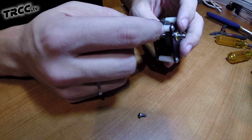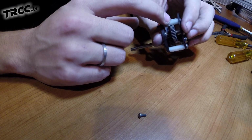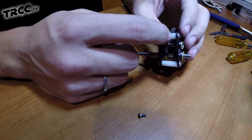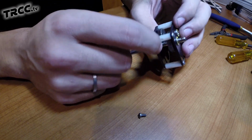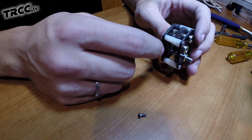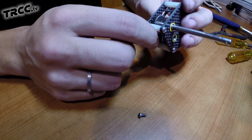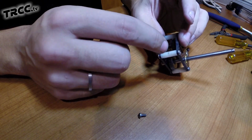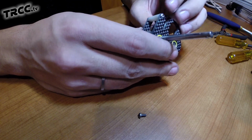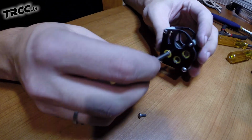But anyway, depending on where you drill the cross holes, none of the gears are in the center except for this top one, which you're not using for mounting anyway. So you can run an M3 screw right through this and nut it on the top. You may want to use a low profile nut. Yeah, I don't think it's really necessary as long as your screw is the right size. So if you mount it like this, you can run the screw up from the bottom and nut it on top. Same with this one, if you go that way or that way. As long as you drill your cross holes in the middle, then you shouldn't have any issue with interference on the gears. So that's a pretty good feature there. I wouldn't have considered that when designing this. So yeah, there it is.